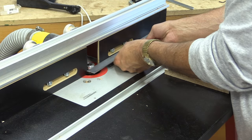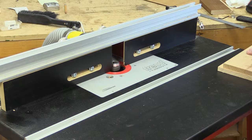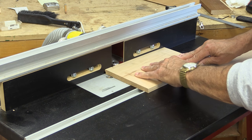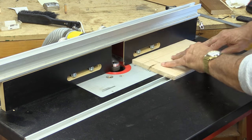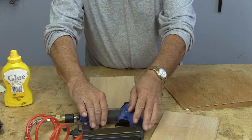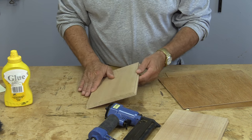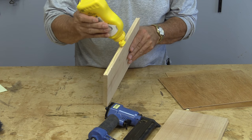I've just isolated the bearing so that it runs smoothly across and we're all ready to go. I've got my 23-gauge pinner here, so I'm going to put some glue down and just pin those so that they stay temporarily. That'll be our medium for clamping.